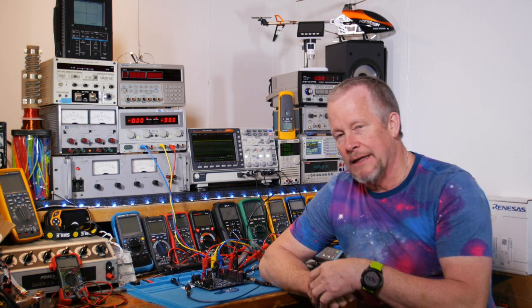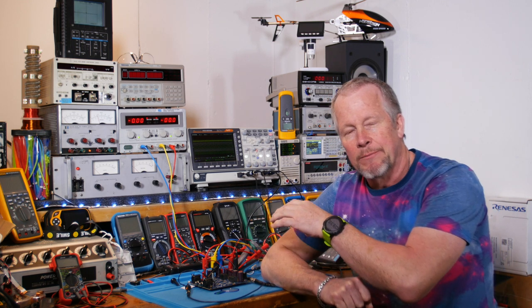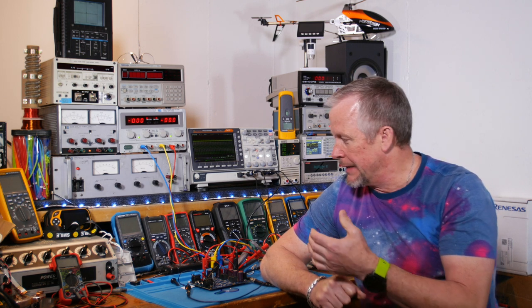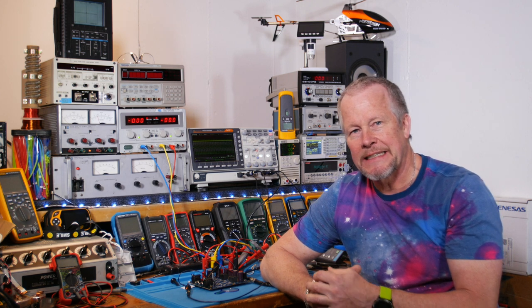I've got a series of these videos in a playlist — I'll link them down below. I've looked at all kinds of different things: performance, THD, phase gain, the Bode plot, that kind of stuff. The last video was about the output stage — it's a bridged output stage using GaN FETs. That's what's really cool about this: not only is it Class D, but it's the future of Class D amplifiers, using GaN FETs, so it's in the mid-90s as far as efficiency — like 96% efficient.